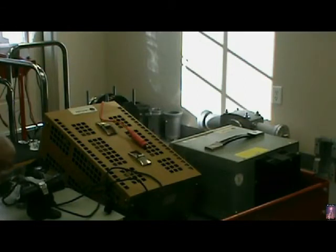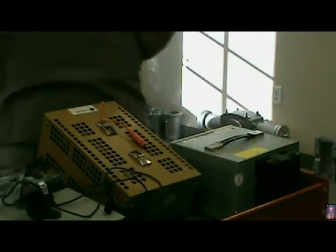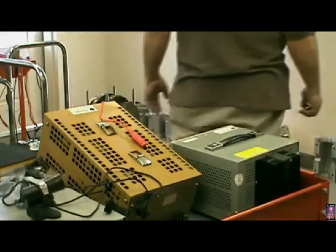Well, it turns out that these things were laid out properly. Everything was done properly, but, okay, see that pad in the middle? That's supposed to be a ground pad. And there's no hole. There's also no ground plane on the back side. In other words, the layout program didn't do that right. And so without that ground, the microprocessor has no ground. And the genius here figured that one out. You can't create one. Well, yeah, he's actually putting a wire on here to create one.